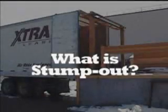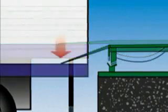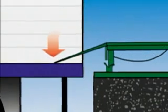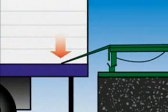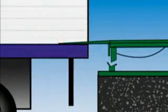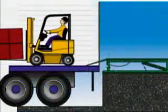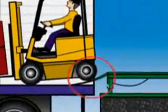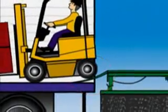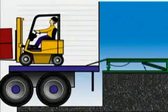Stump out occurs when a ramp stops near dock level but the lip continues to lower with the trailer. That's when support legs interfere with the free float of the dock leveler. If the operator doesn't manually and repeatedly retract the legs throughout loading, the steep angle interferes with smooth passage of the fork truck when backing out, potentially causing damage.